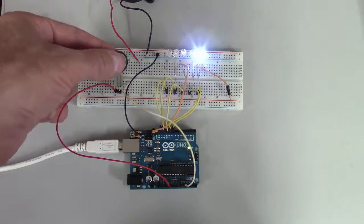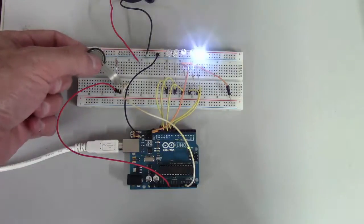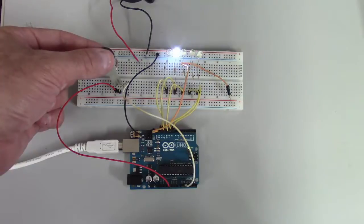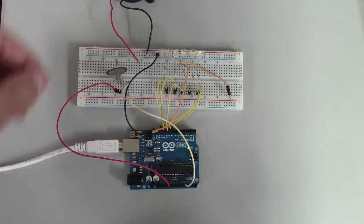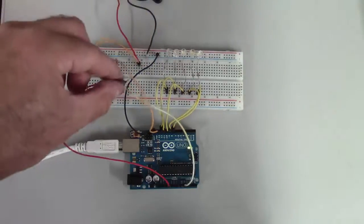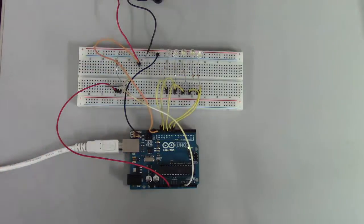Right now I'm using the pressure sensor — it's a resistive pressure sensor, so I have a little voltage divider here set up with this resistive pressure sensor. As I press harder I can make the LEDs move from right to left, and you can actually set up an alarm. I've got some code for an alarm that will sound when the pressure gets too high. The beauty of something like this as a display is it allows your Arduino to stand alone — you don't need the connection to the computer anymore to have a project that gives you data from a sensor.